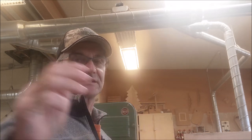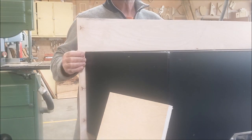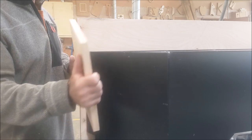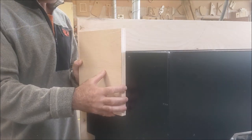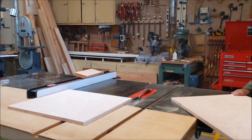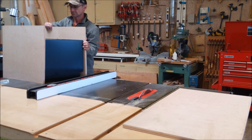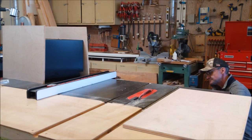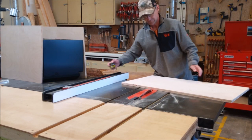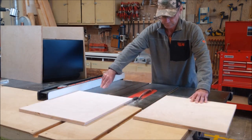Just getting my cuts sorted out. I measured the black box and made it an inch and a half long. The angle is 65 degrees, so I cut the complement of that at 25 degrees on the test board and it sits like that — I think those will work. I'm cutting up my stock. The front and back are not going to have bevel cuts on them — that's the front board and the backboard. Then I'm going to bevel my blade to 25 degrees. I'll cut it right down the middle so I can hold it in there to measure it, using both those bevels.